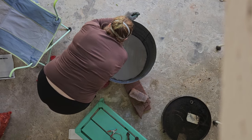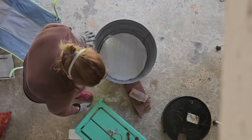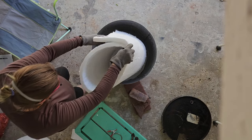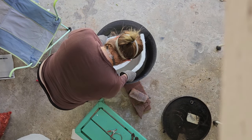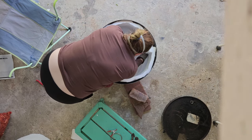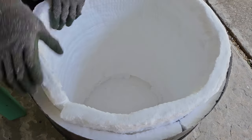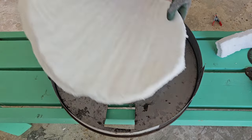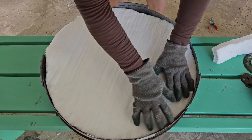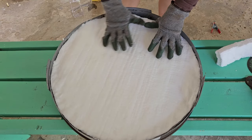Use a clean, dry barrel — if you're not sure of the chemicals inside, double check and make sure it's thoroughly cleaned. If there were ever flammable things in the barrel, check the labels and probably don't use something that has flammable residues. Here we are placing those rectangles. I cut the barrel to a size that would work for the type of insulation I had, so I'd have a little bit sticking out the top to make sure the lid seals well. I also mismatched the gaps on the edge of each layer just to make sure that if those do start gapping while the kiln is firing, we still have another layer of insulation.